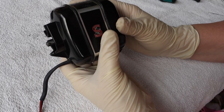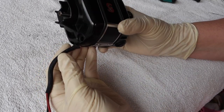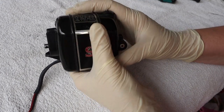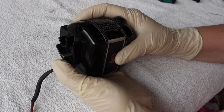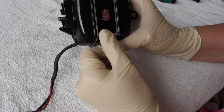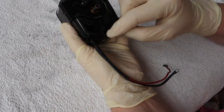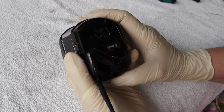This is a motor that I bought from Graham before he retired, and this is how it came to me. I'm going to open it up to show you how a nice, good condition motor should look compared to the previous poorly looked-after motor. I've taken off the motor pulley and I'm now going to take out the brushes and undo the motor housing with the two screws, exactly as I did before.